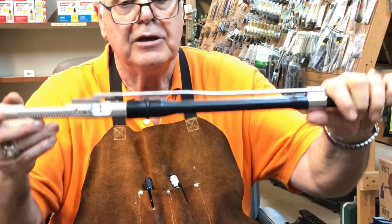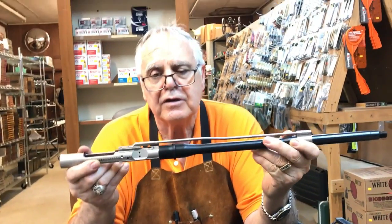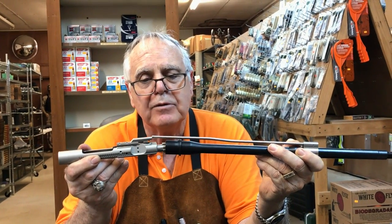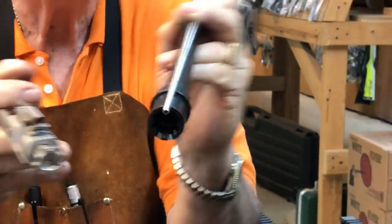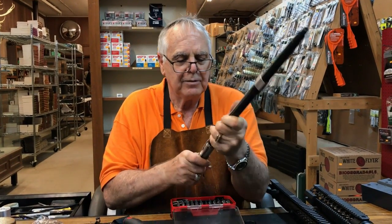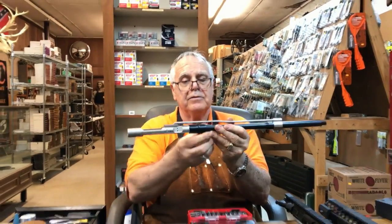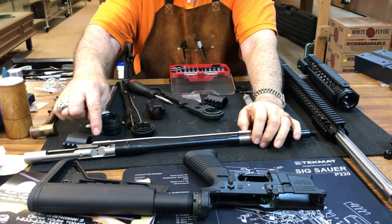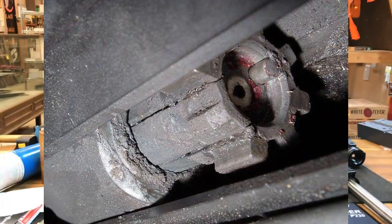You don't normally put the gas block on without having the barrel nut on — that was just for demonstration purposes, to show what an AR-15 system looks like when it locks up. On the M16, this runs about 750 rounds a minute, so it locks and unlocks more than 10 times a second. That's why it has to be very precisely aligned so that the gas tube goes into that little hole — there's not a lot of extra slop; they're about the same diameter plus or minus 15-20 thousandths of an inch. If the bolt's lined up it locks up, and that's how the gas system on the AR-15 works.